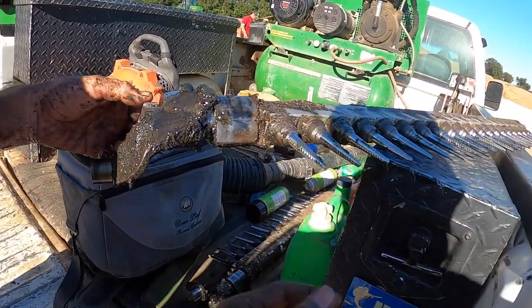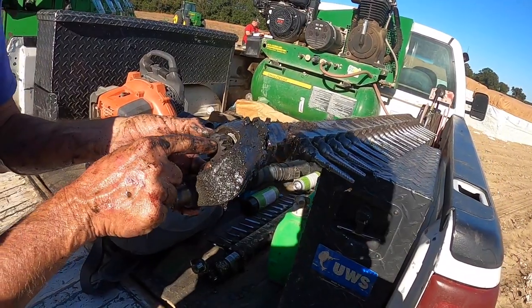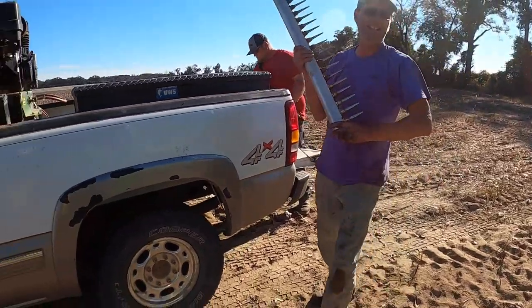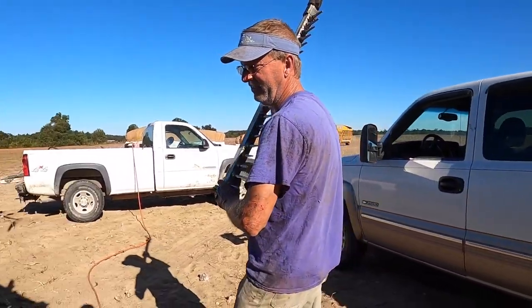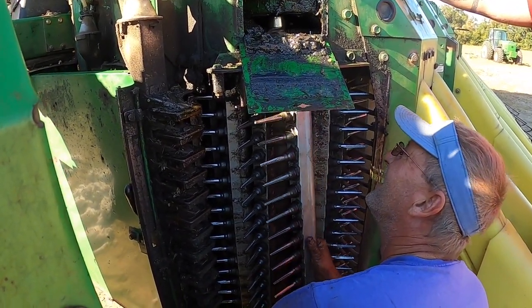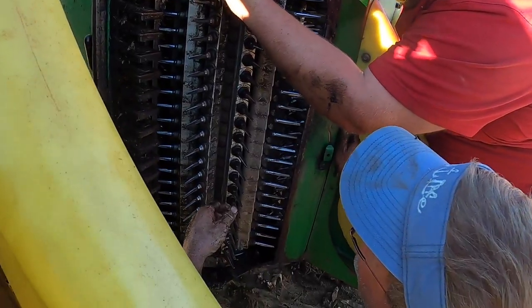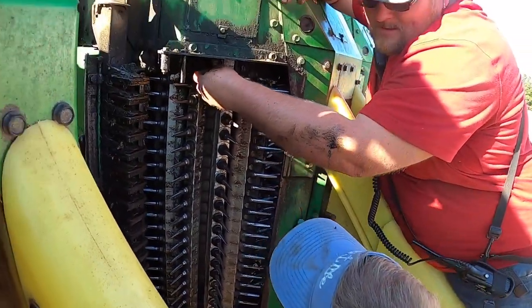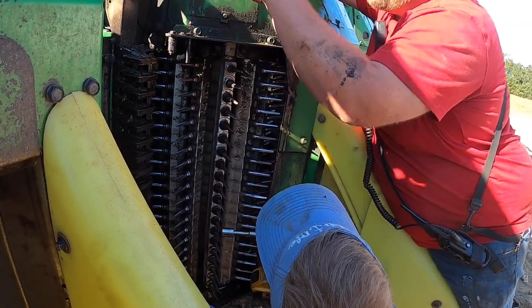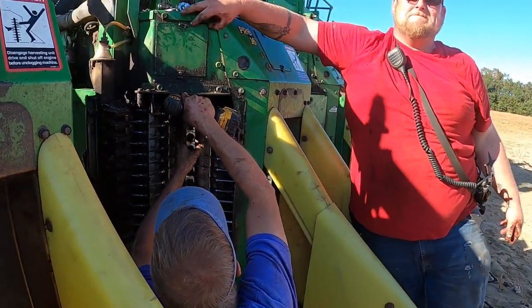Shaft's broke. Oh, the shaft's broke — that's why they ain't turning. Normally the pin will break right here, but instead of the pin breaking on this one, the shaft's turning here but the teeth ain't turning. They turn it down there so it's broken here. The GM don't need to be seeing this because this right here is going to get someone in trouble. I thought I'd get in trouble for falling off that damn pivot, but he was happy I got that on camera.